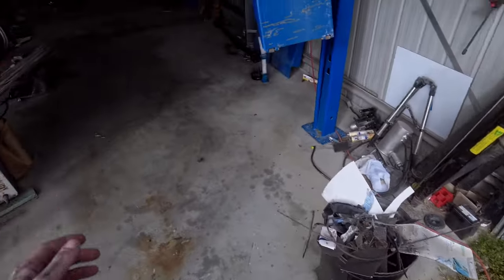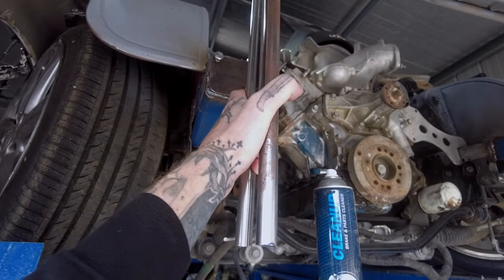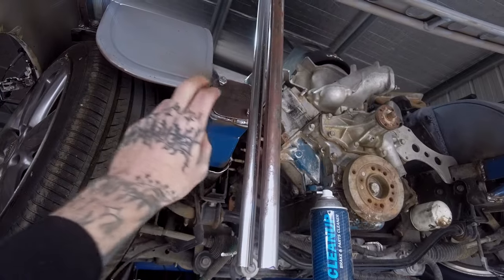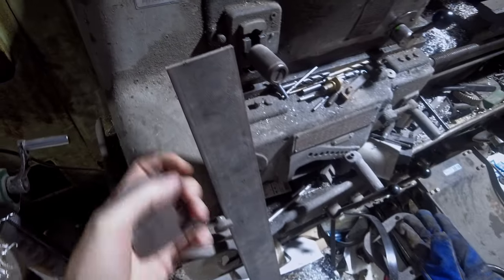Now that I've got my shit somewhat together, I'll get this thing back down on the ground. While I was cleaning I also remembered I need to make the front plates and at least tie this in — shouldn't be too long. Now that I've got some fresh eyes it should be a lot more straightforward. I pulled the front side of those brackets off, marked them, and I know how I'm going to locate them — I'll do one bolt in the middle where I can weld the tube over it. I also spotted this, which is pretty well perfect, so I'll make a couple of these quickly.